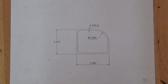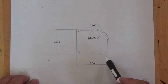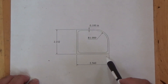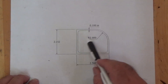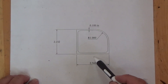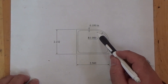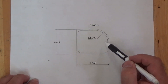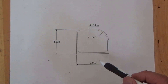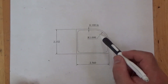The machining strategy is going to be simple enough. I'm just going to take that half-inch end mill and machine around the perimeter — climb around it — and then go to the inside and machine out all this material, leaving about 10 or 20 thousandths on every surface. And then when I get to the arc, to machine around the arc, I'm going to do the only thing I really can do, which is essentially etch-a-sketch my way around that arc in order to approximate it.